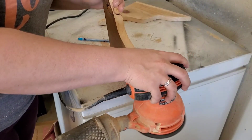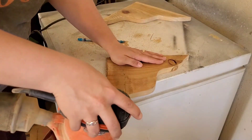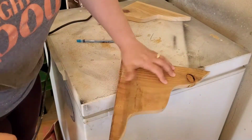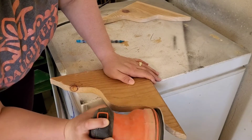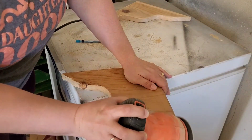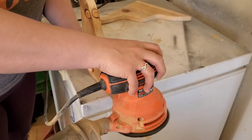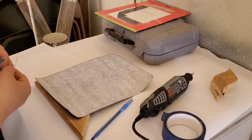On my corbels here I wanted to curve the edges of that cut line. I also wanted to smooth the wavy cut line on the front, and then the sides — I wanted to make sure I sanded them and got as much of that old stain off as possible. On the straight edges I was trying not to round off the corners.